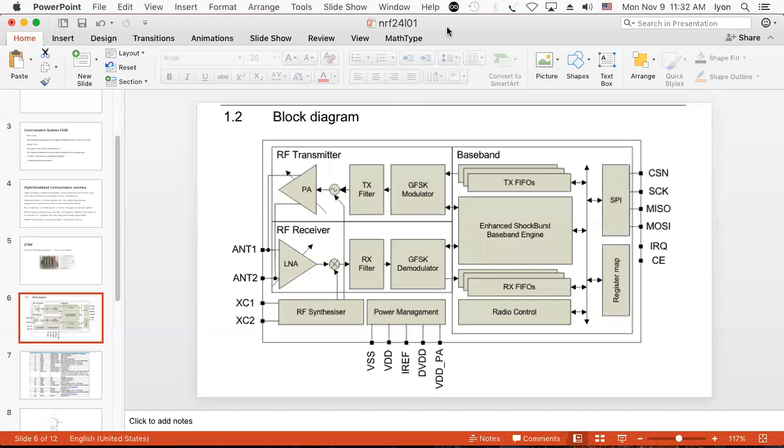So that's pretty cool. Let's see now, what else do we need? SPI, we know what that is, right? Because we've been playing around with SPI. So these things have SPI interfaces, and the SPI interfaces are going to give us a high-speed bus with MOSI, MISO, serial clock, and a chip select, and an enable. We can use the enable to turn it off.